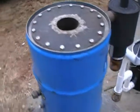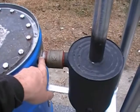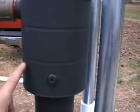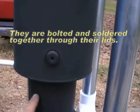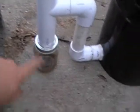Moving on around — this is the side view of it. Right here is the output gas that comes in here. It goes into the vortex. The vortex I made with two cans: one is a gallon paint can, and at the bottom I've got a quart paint can. Basically the gas will come in here, goes down to the bottom, then comes back up the tube. Here's my first capture for capturing tars and drips — I've actually got two on here, one here and a second one down here.